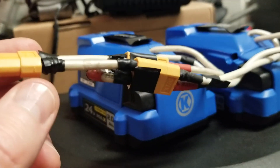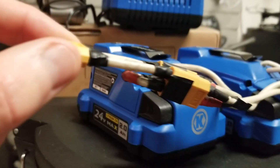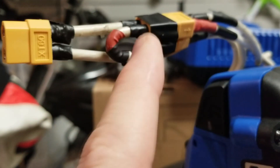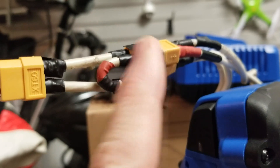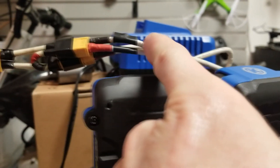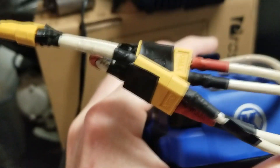To make it inline, there is a very small 10 gauge wire under here looped around in a little horseshoe shape. I stripped the wire, soldered it with shrink wrap and electrical tape, and looped one side into a male connector — the positive side. Then I looped it around to another male connector for the negative side. So we're going positive, looped around to negative, both male connectors. The female connectors from our battery packs feed into this loop — rear battery on one side, front battery into the other.